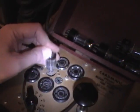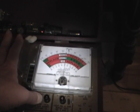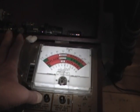But as before, even though it's new old stock, I will definitely test it, so let's get it out of the box. There we go. Turns out it's actually an RCA, so somebody reused that box, and this may actually be a used tube. Let's see how it tests. No shorts, no leakage, no gas. Not great, although it's still slowly climbing. Better than the other two, but not great, so I think I'll go hunting for another one.